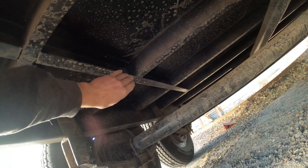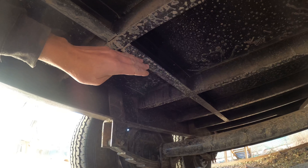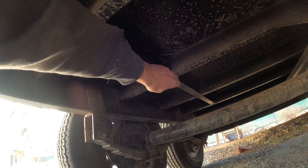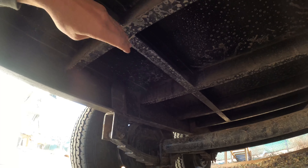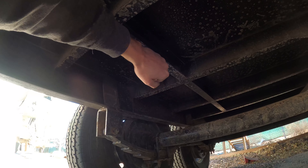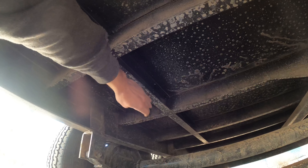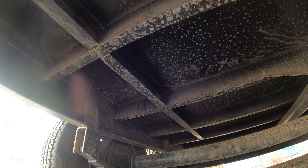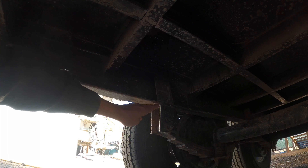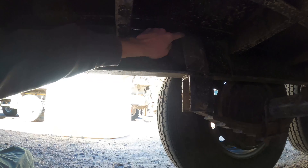I added these extra reinforcements in here because when I was building this trailer I had an idea I wanted a full-size skid steer, so I wanted some extra reinforcement. This is where the tires to my skid steer now roll — just a little bit of extra reinforcement so we're not putting the load of the skid steer on just the eighth inch plate floor. These over here are extra reinforcements because we welded the flange of the C-channel, and we didn't want the C-channel to have a bunch of stress at that angle, so we welded a piece from there up to the inside of this angle.